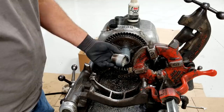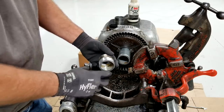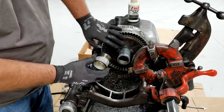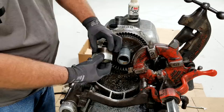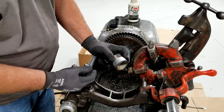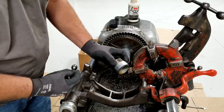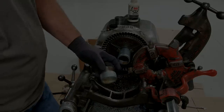Okay, now we need to complete this operation. We need to deburr, we need to thread, and hold it. We can't possibly do it with this chuck. These things have serrated jaws, and it'll just clamp down on these threads and absolutely destroy them. And because you'd be holding clear out here, just threads. So let's get the nipple chuck in and finish up this pipe nipple.